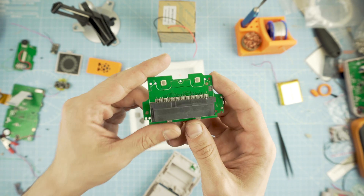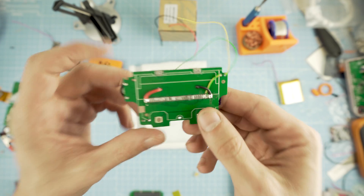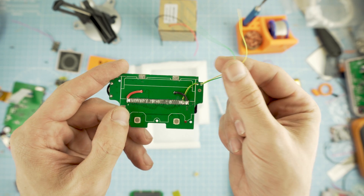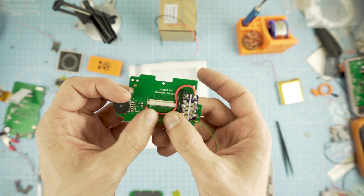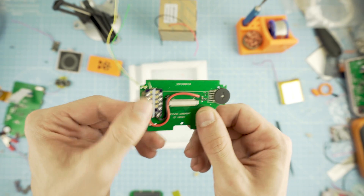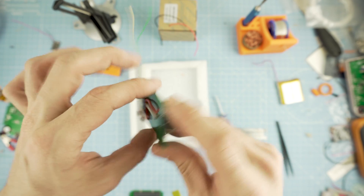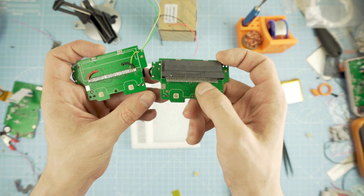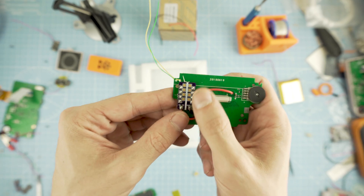The first thing that needs to be removed is the cartridge connector PCB. Unscrew all six screws so we can pop it out, leaving us with an empty back shell. The cartridge PCB needs to be modified — with a clamp just remove the plastic part of the cartridge connector and clean the pads with a hot soldering iron. This reveals the connector from the Pi to the GPI case. We'll need the side pins for power to the Pi and two pins for USB. On the GPI PCB I also added a splitter for power to both the Pi and DPI adapter. You can find the Gerber files in the description — it's around five dollars for ten pieces.